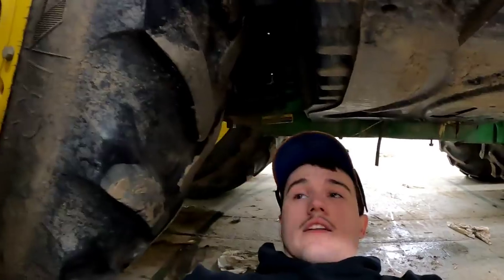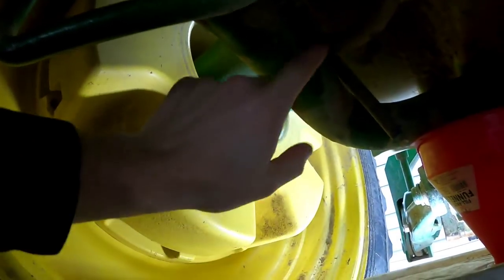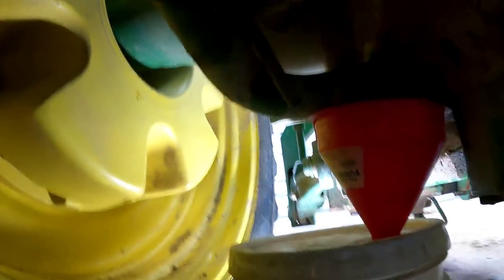Hello, I'm back to the farm after my couple days off. Nathan just told me what to do here on the 8R — we're sliding under it to change the oil in the bottom. This arm here has a pipe with hydraulic oil going through it, and we're leaking right here. So we've got to take this off. We've got an O-ring for both ends just to be safe, even though it's only leaking out of the one.